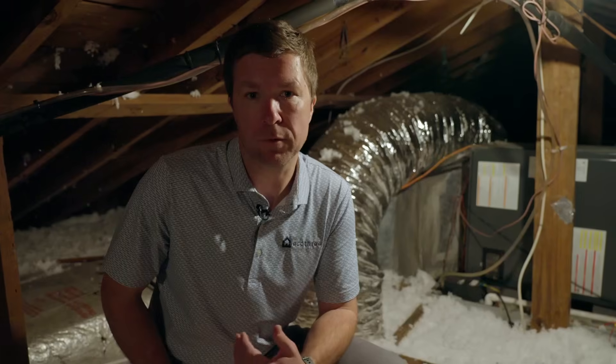One of the things that we do is come in, find these top plates — either interior or exterior top plates — and seal them up properly. It's a very cost-effective and effective upgrade. If you can see the ceiling joists in your attic, you need more insulation. Airflow deficiencies in the attic are something that are so repetitive, and again, it's a very cost-effective upgrade to make.